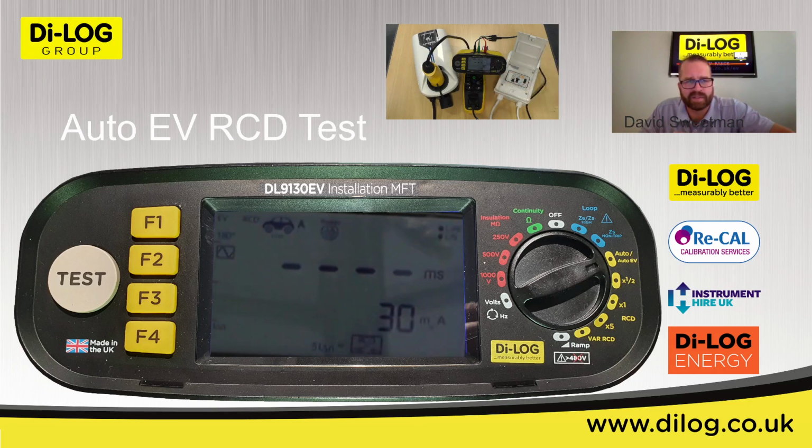Okay, that's the final one. So I'm just switching that back from position charge point control pilot A to C. It's picked up the voltage and it's tripped. Okay, so at this particular point I can press F3 and it will recall my results on the screen. Or I can continue to do a ramp test.